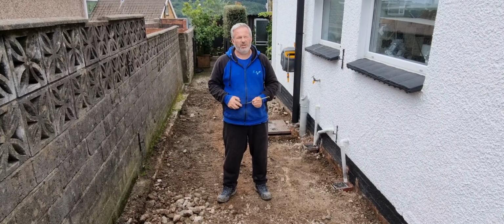So Brad broke this. We've told the client about that. It was right tight to the surface, a little bit unexpected. Sometimes they are, sometimes they're not, but he broke it with a breaker. So it's not his fault, it is what it is. So what we're going to do is replace the whole gully, take it back to that plastic to clay join, that rubber connector there, and put a new gully in there. That one down there that Fraser's showing you now is all broken anyway. It's nothing to do with us, but we're going to replace that as well.